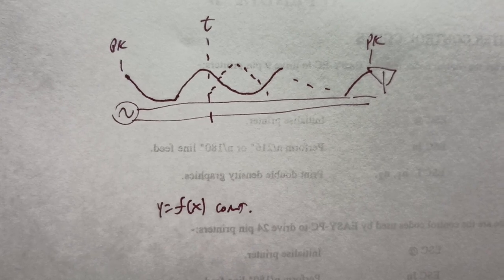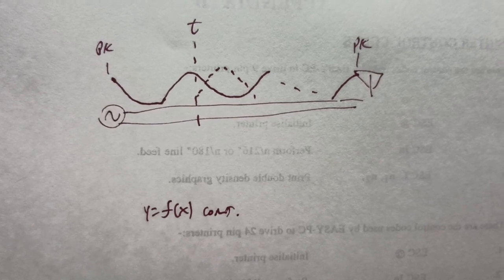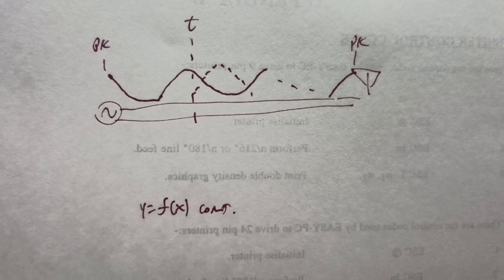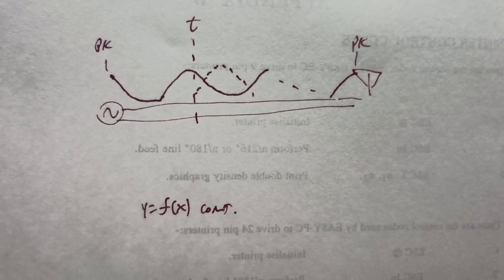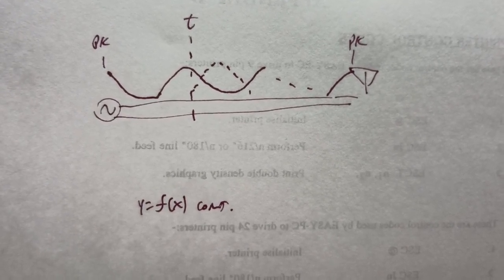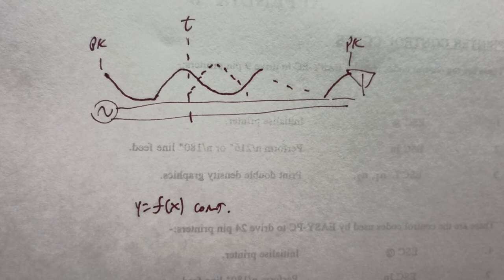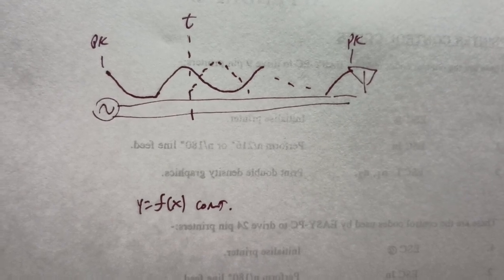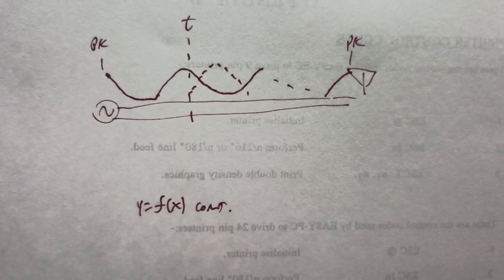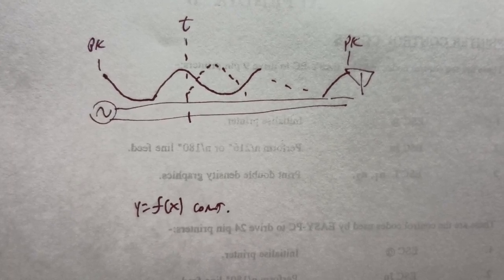The practical way to approach it is to find the stated velocity of the line. For polyethylene, it's 0.67. It's not a real accurate number, but it's better than nothing. And use that factor to cut the transmission line to half-wave intervals. Like the antenna wires, like reducing the length of the wire for the velocity through air of 0.951. The velocity of the transmission line is slower because the EM fields are going through a solid dielectric, such as foam or polyethylene or Teflon.